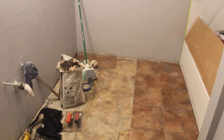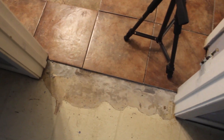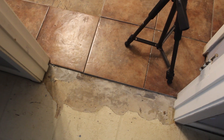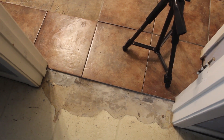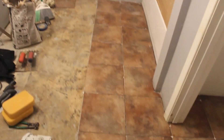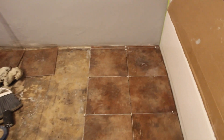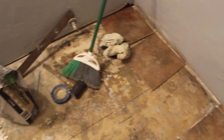There's one little problem here — there are 21 tiles plus some little skinny ones on the end. I don't really like doing that, but you want your tile in the entries to end underneath the door, in the middle of underneath the door. That's what I did here, so I didn't want to have cut tiles on this end. I've got small pieces down here — they're an inch wide. The base is going to cover part of that anyway.